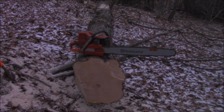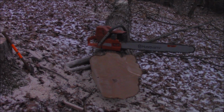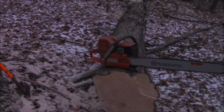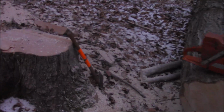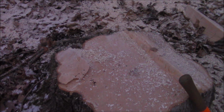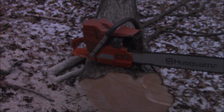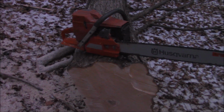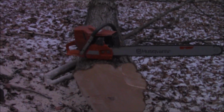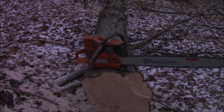Once I got that thing started, actually it's pretty useful. It cuts real fast, real fast. One of the things that is important to me on the saw is I spend a lot of time getting off the throttle and then looking at my stump to make sure that I've got my hinge the way I want it. And so you see the saw idling in the stump, and then I come back around and jump on the throttle. It has to have the torque to push that chain, even if it's a little pinched. Otherwise, now I have problems.